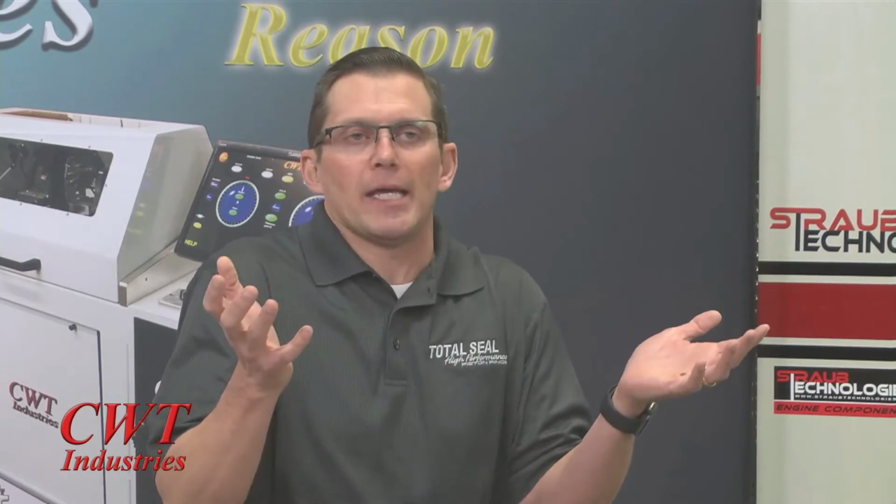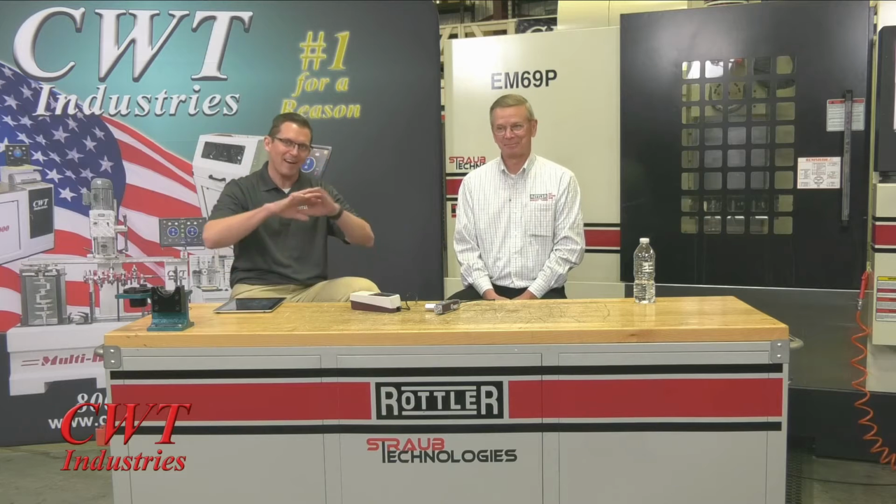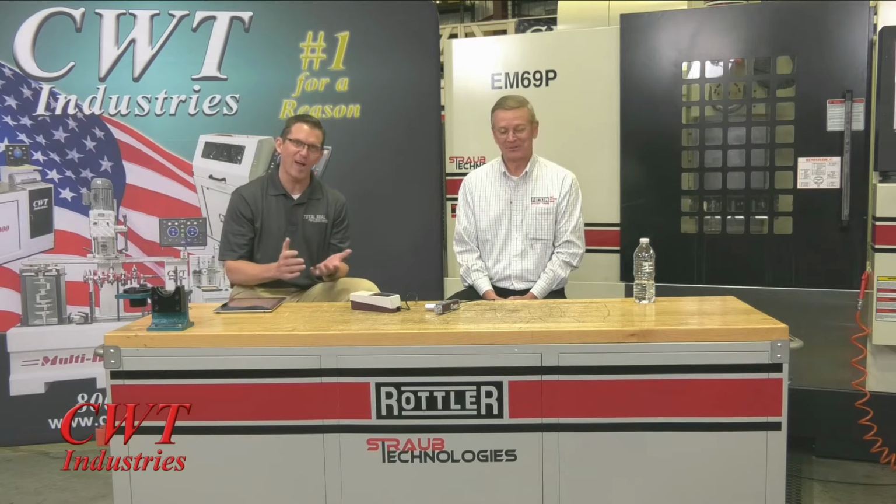But if you've got a really dense block with a lot of material in it that's, say, cast iron, pretty rigid, the compacted graphite blocks, they're not moving. You're just wasting your time doing that. So some guys see advantage, some guys don't. So it's definitely a mixed bag based on the application, which will be the answer to most questions. Yeah. The application dictates everything. That's right. We all wish there was some magic pixie dust you could sprinkle on things to make everything work, but it really doesn't work that way in the real world.